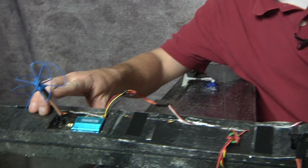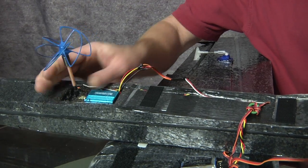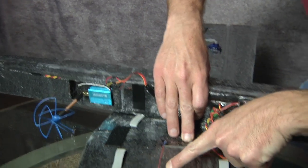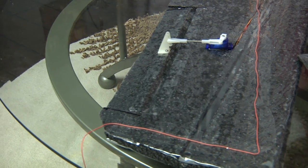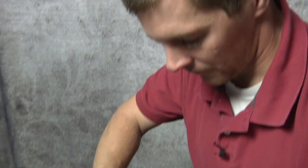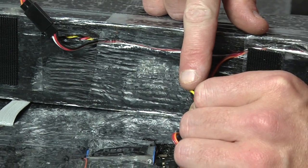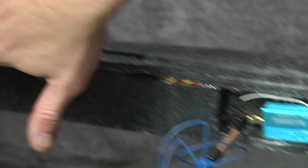The last part of this installation is using your antennas properly. Your video antenna must be upright — this gives the best signal strength and will work best with your video system. For the 72 MHz control, I keep my antenna as straight as possible, running it out the wing. You can turn it 90 degrees out the back of the wing, or just let it dangle — the trick is to keep it as straight as possible. That wire that's all twisted up is the elevator wire. It's twisted because it bypasses the video transmitter — any wire that gets close to the video transmitter should be twisted to eliminate interference, otherwise the servo will be erratic.